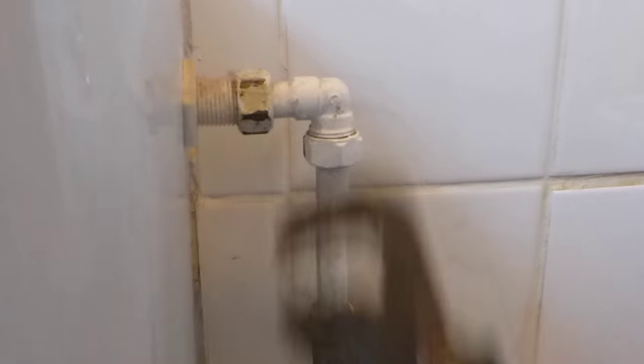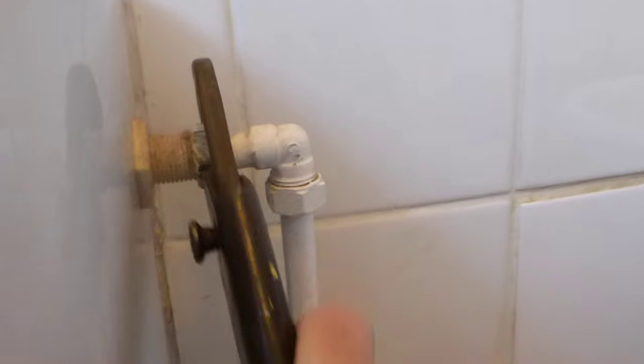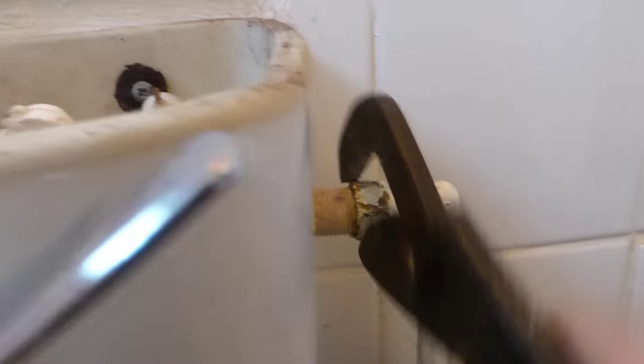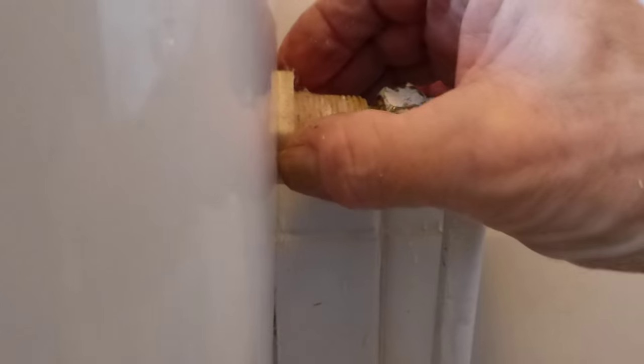The first thing we're going to do is undo this union here. You can use a spanner — that's fine — or if you're a plumber like me you've got access to grips, what we always call footprints. These are the ideal tools, but a spanner will be fine. Just give it a turn. You might find the valve tries to turn within the system, but it'll wedge up. If it does try to turn, just get a spanner to hold against it so you can undo it properly. Once you get a few turns on it, it should just pop out. There'll be a little bit of water left in the valve itself.